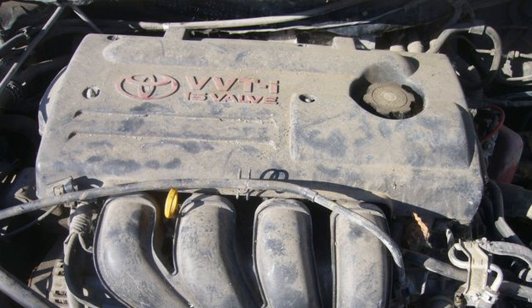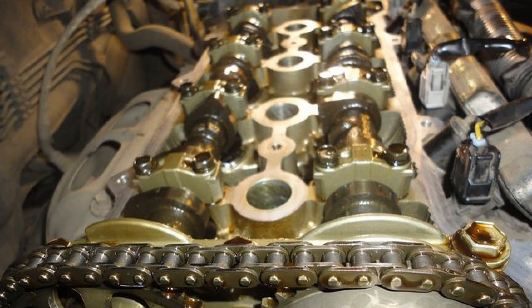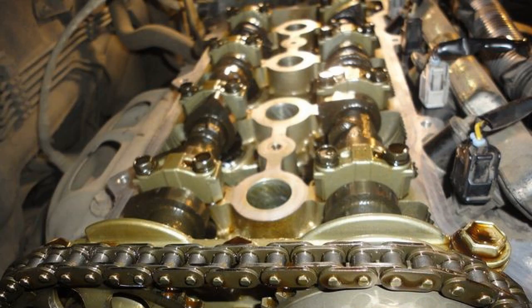To make the crankshaft more compact and reduce friction, the length and diameter of the crankshaft journals have been reduced, resulting in higher loads and faster wear. A pulley is mounted on the crankshaft to drive the auxiliary belt. Piston skirts are made lower in height to also reduce friction losses, but this had a negative effect on the cooling ability. The pistons were created T-shaped, and they started knocking much earlier when shifted to TDC compared to previous models. The pistons are connected to the connecting rods by floating pins, and the caps sit on bolts screwed directly into the bottom of the connecting rod.